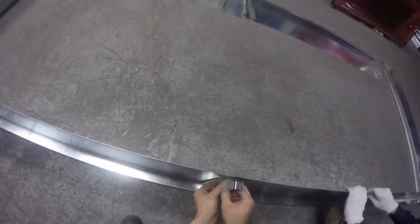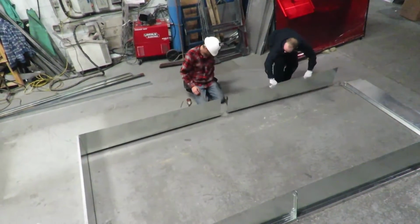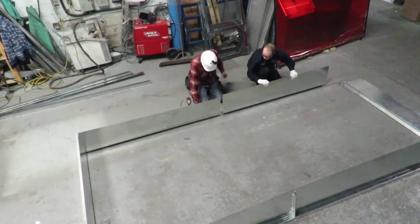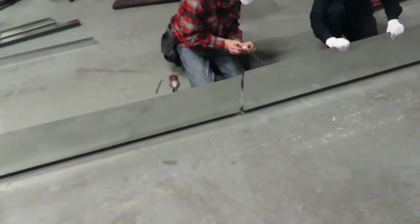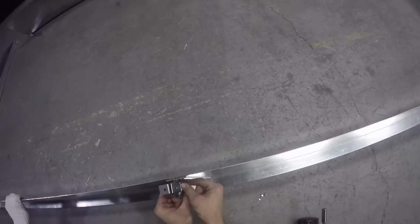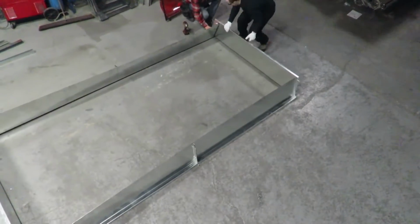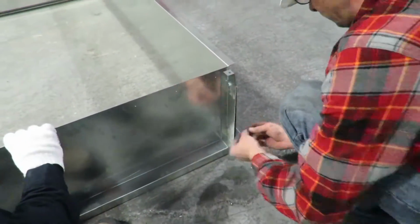Once again, make sure that there are 2 load support brackets on the side panels, and hand tighten first, using your power drill to tighten it all up afterwards. Repeat with the other side. We recommend the use of a drift pin to align the bolt holes. After assembly, the support brackets should appear as shown.